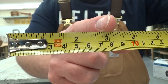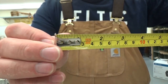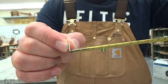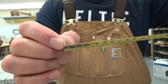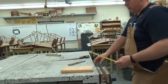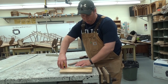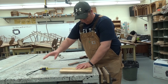These tape measures are used for rough measurement only. You don't want to use a tape measure for doing specific or fine measurements, because of this — you'll see how the blade moves back and forth. That will throw off all your measurements. So we always use this for rough cutting and rough measuring. To measure it, I'm going to go here, pull across like that, I can lock my tape in, and put it further back — it's more stable.